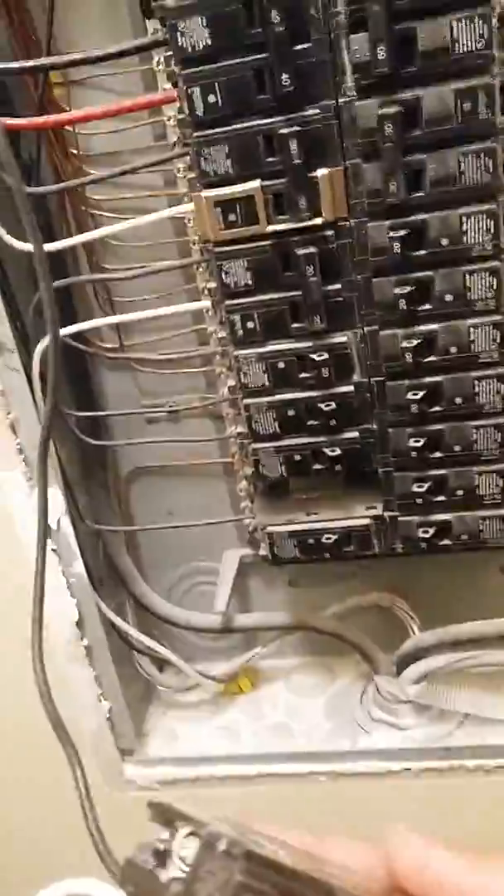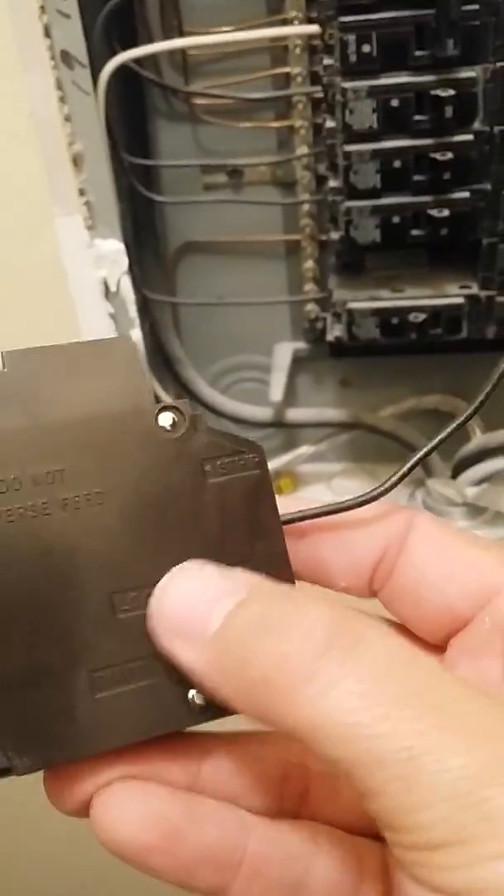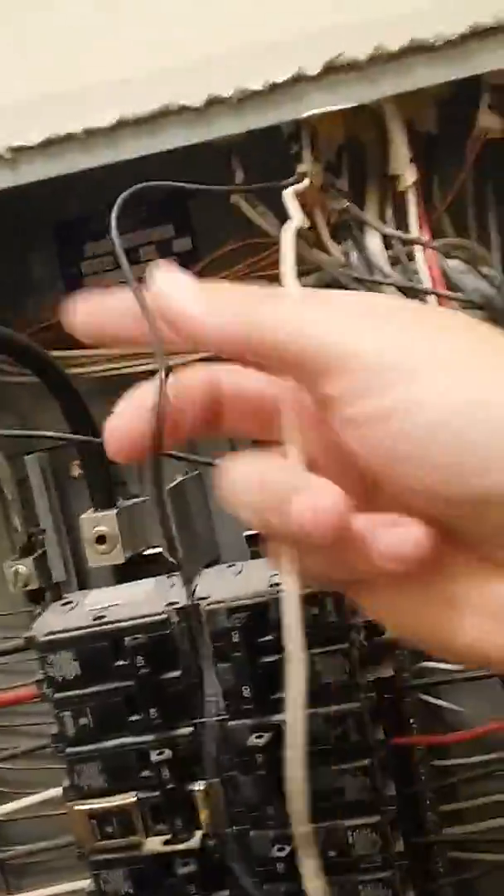I'm going to show you how to hook it up quickly. I've got the old breaker out and this is our new one. The hot wire — in this case the black wire — goes right here under this brass screw; it even says 'load' on it. On the other side of the breaker we're going to have a neutral load — that's your neutral wire. Make sure you're on the same cable; took a few minutes to go through this assortment and find it. This one will go where that load neutral is.